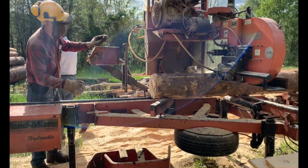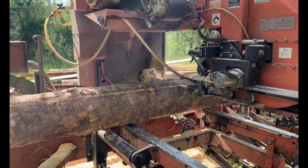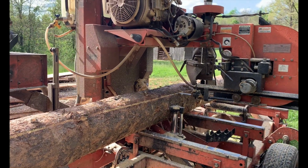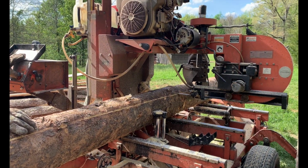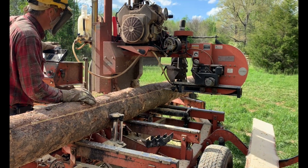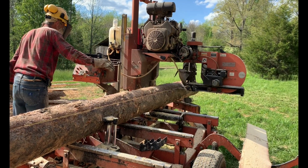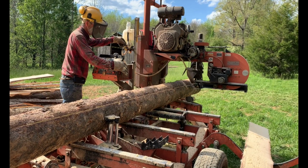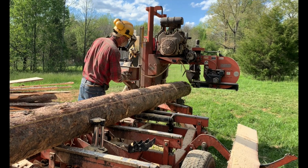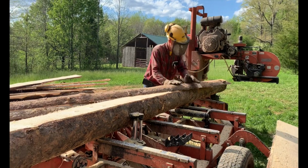Back on the farm. Today we're going to be sawing lumber. This is yellow southern pine. In this stack you're going to see black pine, maybe a few loblollies, and mostly Virginia pines. This stack of logs was cut in December and January, when the sap was low on these pine trees. We're going to mill these up to 1x8s and 1x6s, along with some 2x4s. These are going to be leveraged for some structures on the farm, but let's get on with it.